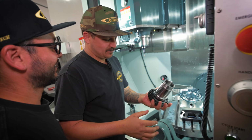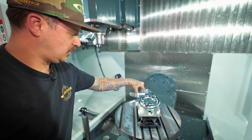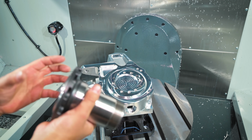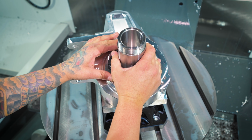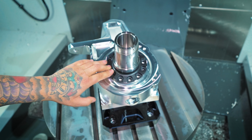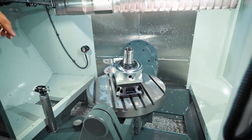Oh, so here we have our Pro-Am trophy truck snout. It's a 12-bolt pattern. We did 4 of these as through holes, so I actually run a longer bolt all the way through, nuts on the back, and then these are all threaded because we can't get through bolts on those. So a little different step, but this thing's a pretty good vacuum seal on here. It's actually pretty tricky to get lined up because you can push it in and it pushes itself back out because of the air in there. So pretty tight tolerance there. Literally airtight. So yeah, pretty cool.